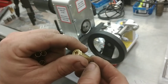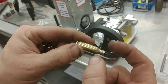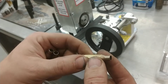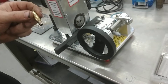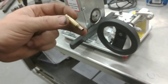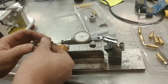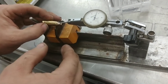After you expand, just like we do with the 6.5-284s, it will straighten that neck out to the body so you don't have body-to-neck runout issues. Now we're taking off - depending how thin you're going - between 3 and 5 thousandths off of the neck thickness. So long as you have less runout on your neck than you're cutting for your thickness, you'll be okay. This is just a homemade little concentricity checker.